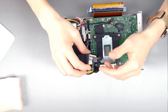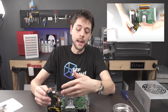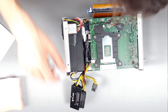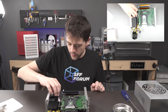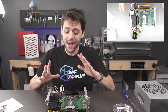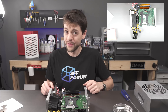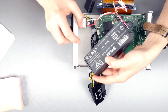We also see the beginnings of the DC-DC converter, which takes the DC power from the AC-DC transformer and turns it into voltages the system can use. This is an HD Plex 160 Pico-style unit — actually a prototype of one of the very first 160s that Larry from HD Plex was developing. The heatsink is not milled and some parts are taped off to prevent electrical shorting. The filtered three-prong jack has a grounding wire going to the chassis and the rest goes via a two-pin Molex bridge to the AC-DC unit.